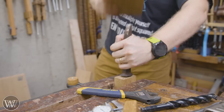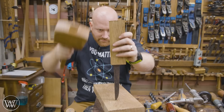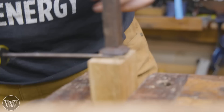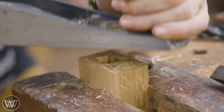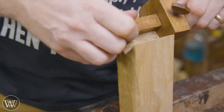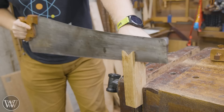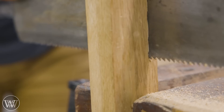In the end I couldn't get it perfectly flat to the shoulder, so I took it out and planed the shoulder down to make it match. I drive it down to about a sixteenth inch away from the shoulder and leave it there, then use the plane to adjust the shoulder to match the chisel — that way I get a nice even fit. You want that final drive to be at the very end. It's a balance: too tight and the handle splits out, too loose and the handle falls out. It's something you've got to play with.